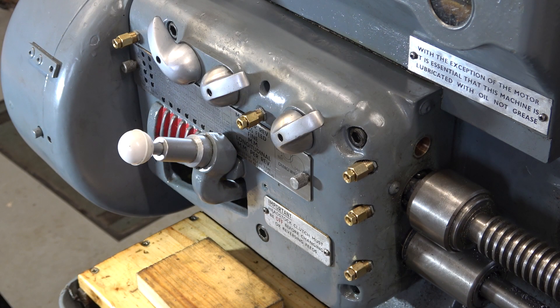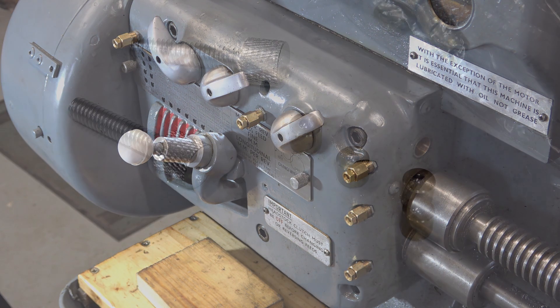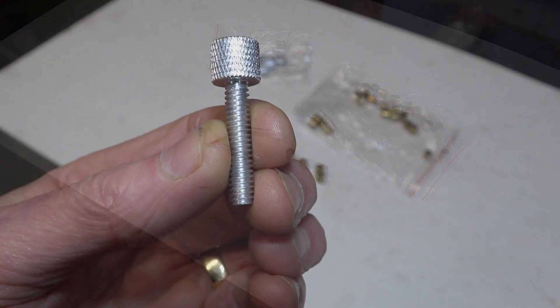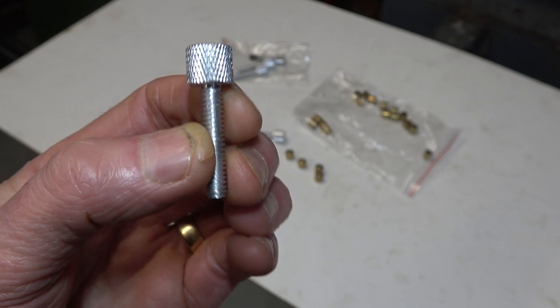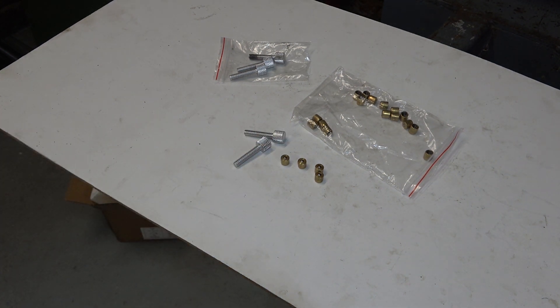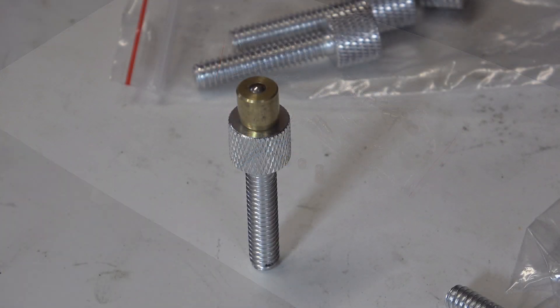I made those fittings back in November of 2020 — I think at the time I just needed something to do. But as it's turned out, technically it's okay, but practically speaking it's too elaborate and I really need something much simpler. So on to Plan B. This time I've decided to make some simple oilers and I've looked for parts I can adapt. Five aluminium quarter Whitworth screws with knurled heads were about five pounds, and then 20 oiler inserts were about the same — about five pounds delivered. It's just a case of machining out that knurled head, pressing in the oiler insert, cutting the thread short, and drilling a hole all the way through — times five.